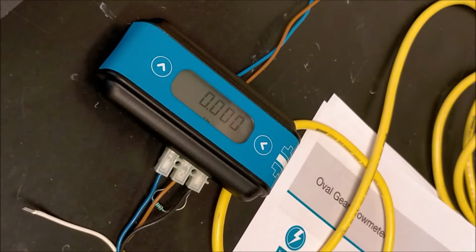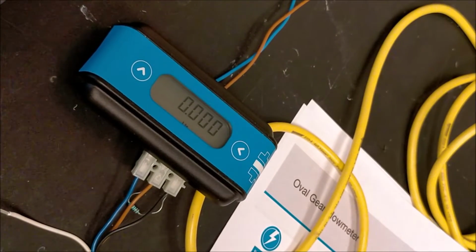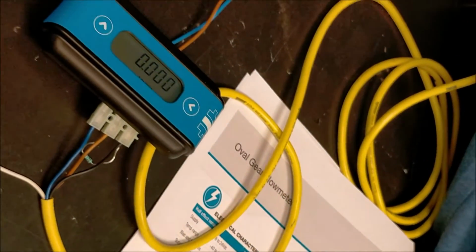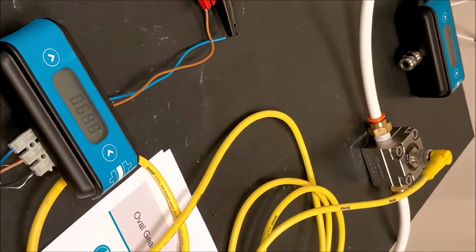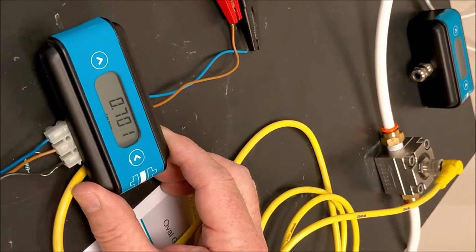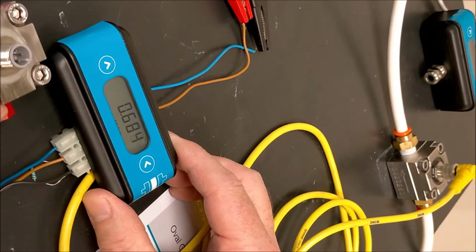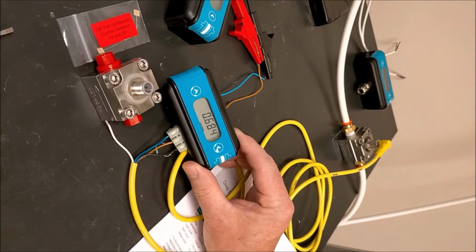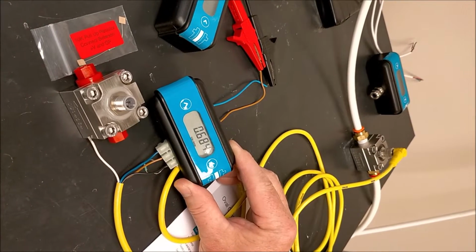Then turn over and we can look at the display. Turn on the power supply for the meter itself, so you now have your 4.5 plus volts, and then turn on your pump for your flow, and there you have it. With the pull-up resistor already in place, the pulses come out from the NPN on the flowmeter itself, and in this case we have already preset this to give us the desired flow rate on our display at around 0.7 litres a minute.